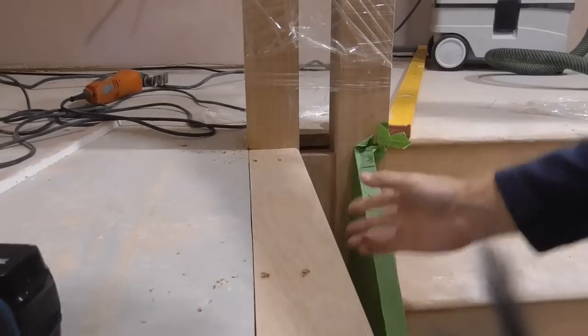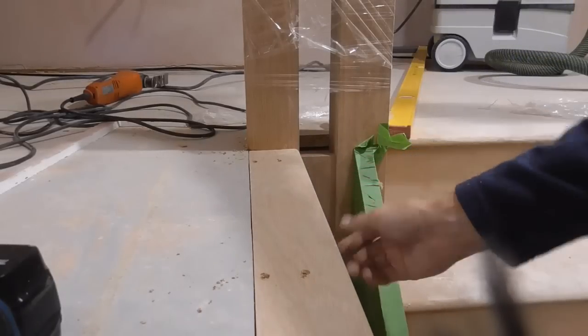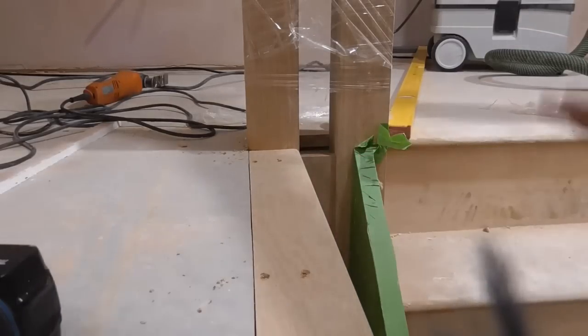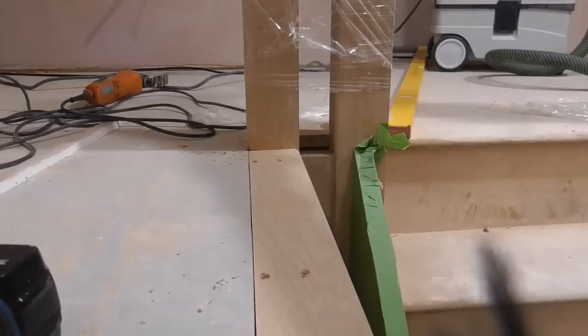Although these stairs didn't come with any aprons, we decided not to put a bit of plasterboard in here because it would have been really fiddly for everybody. So I've just fashioned a little bit of capping that I had left over to make a tiny apron there. I don't think it will look odd when it's all stained in, so just a tiny bit of capping to go on top of there and get one of these newels.